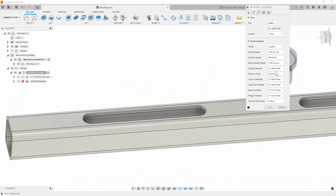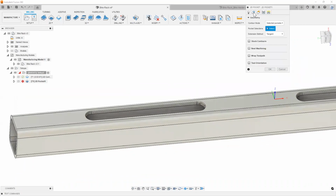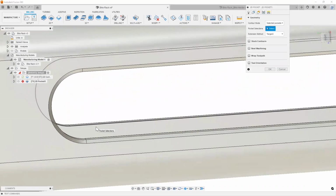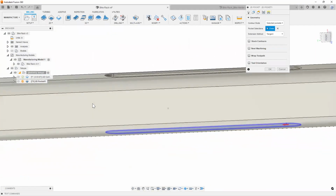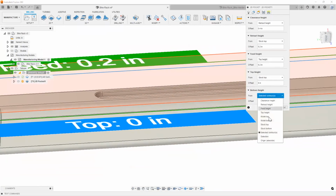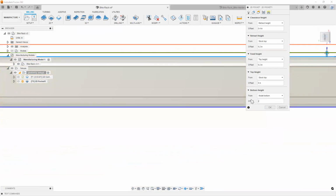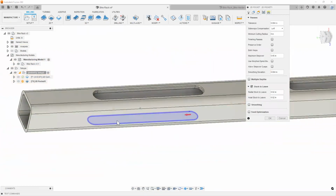I'm going to use that same 3/4 inch flat end mill. As you can see, we have it already brought up here, technically because it's the only tool we have in our library right now. Go into that geometry tab. Again, simply doing what we did earlier, selecting this bottom geometry here. I'm going to say I want to cut all the way through the model bottom, again giving it that negative 50 thousandths to make sure we don't have a weird lip at the bottom.